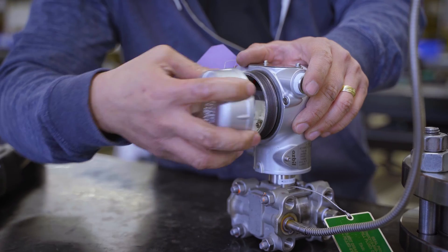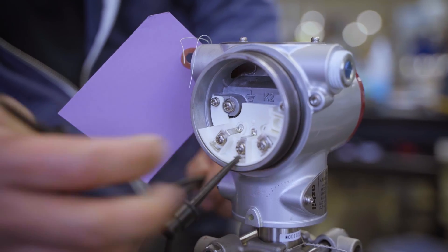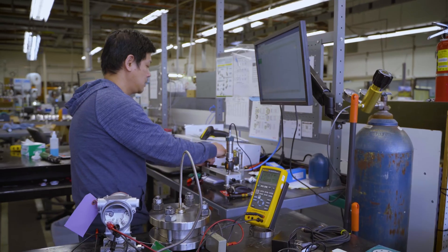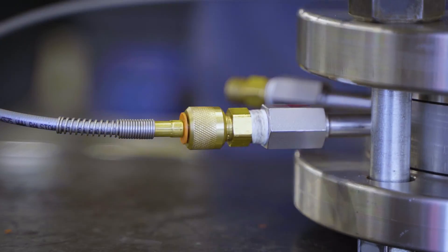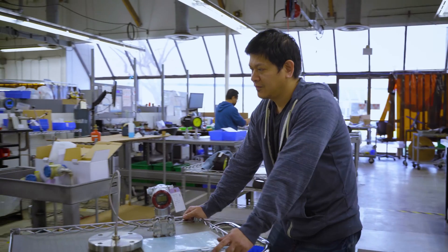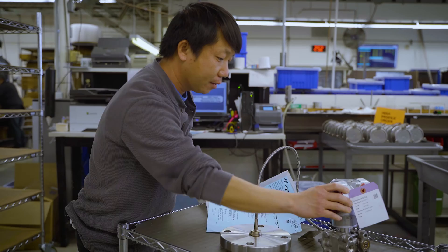Here the assembly undergoes three tests: a static pressure test to assure a leak-free assembly, a static vacuum test to assure a complete and balanced fill, and finally a five-point span calibration to assure linearity. We are also open to re-span or reconfigure the transmitter if requested. The unit has passed calibration and moves on to final inspection before finally heading out to shipping.